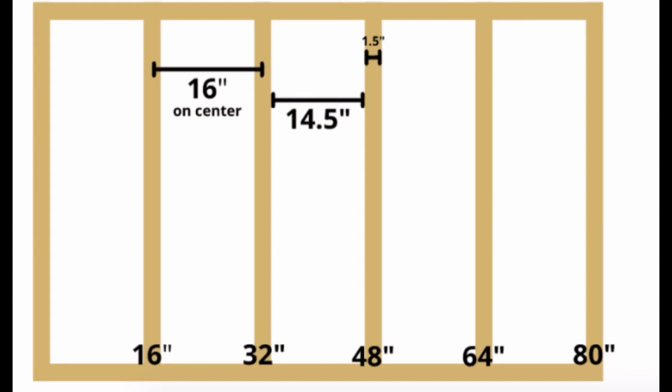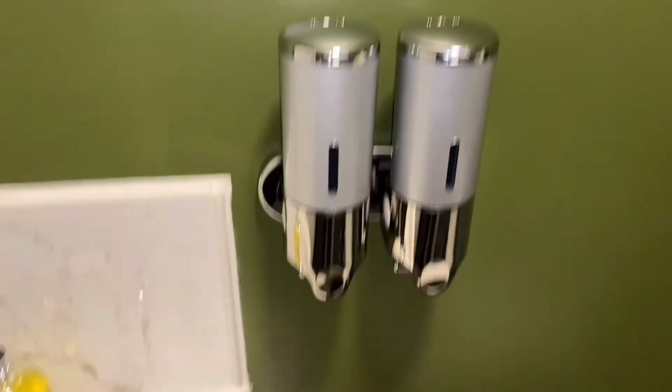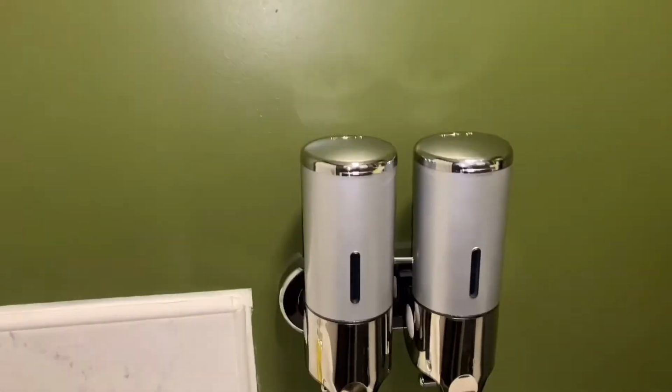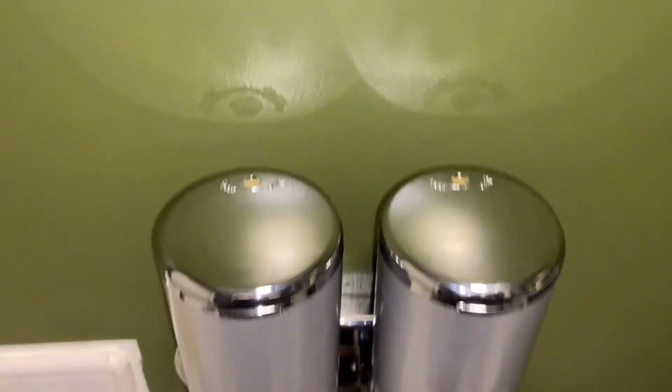And I would recommend that you place two or more stripes of masking or painter's tape at different heights on your wall and mark all objects on the tape rather than on your wall. That way you don't have to scrub off pencil marks or pen marks from your wall. And remember, studs run straight up and down, and pipes and wires frequently change direction. But like I said, just get a pipe, cable, or stud finder detector to be 100% sure. Although metal nailing plates are usually installed to protect pipes.